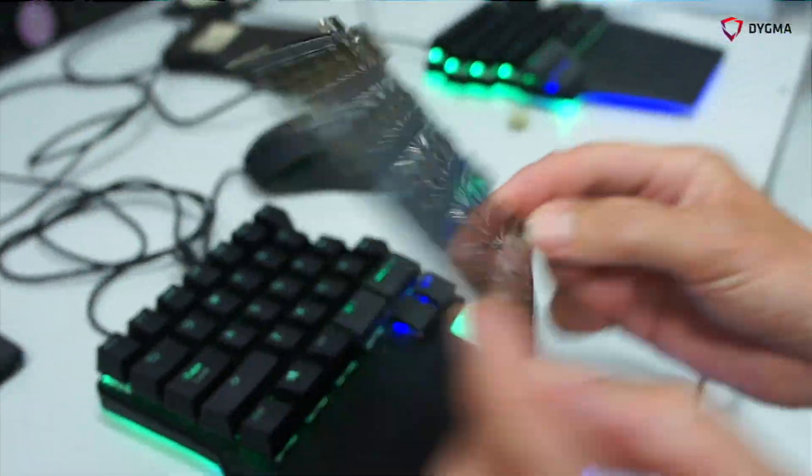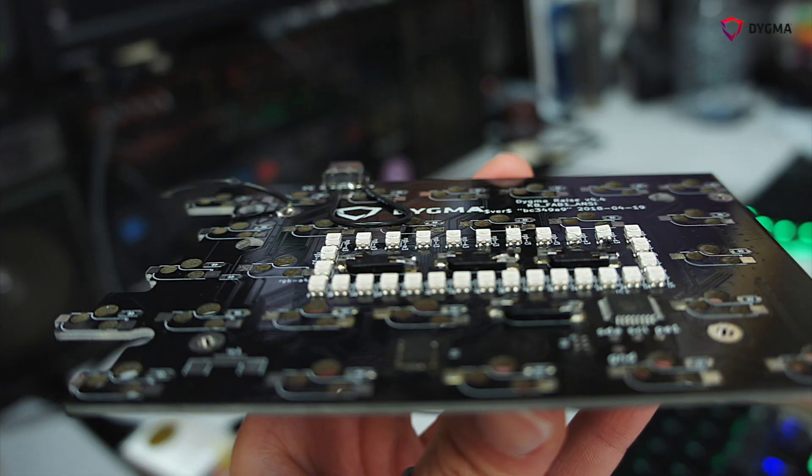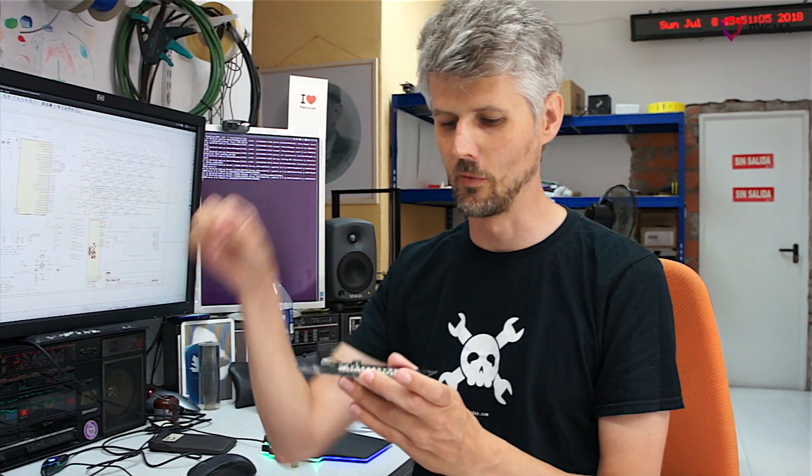This is, for example, the left-hand side of an older version. That gets sent from the PCB factory to the PCBA factory — PCBA stands for Printed Circuit Board Assembly. They take all the components; in the factory a machine would spread solder paste on all the exposed metal, then a robot would place all the components quickly. That goes on a conveyor belt through an oven, melting the solder so everything is soldered on. At that point it should be working and functional as needed.